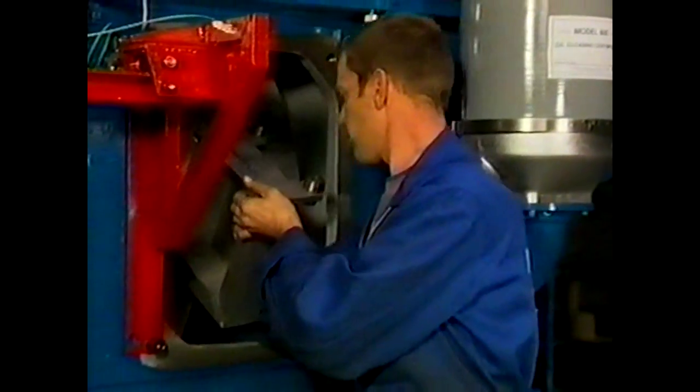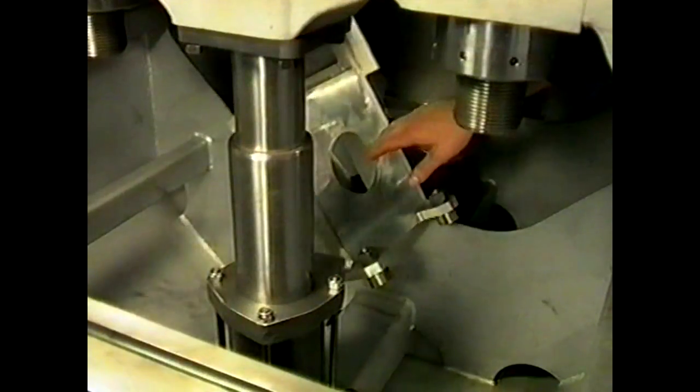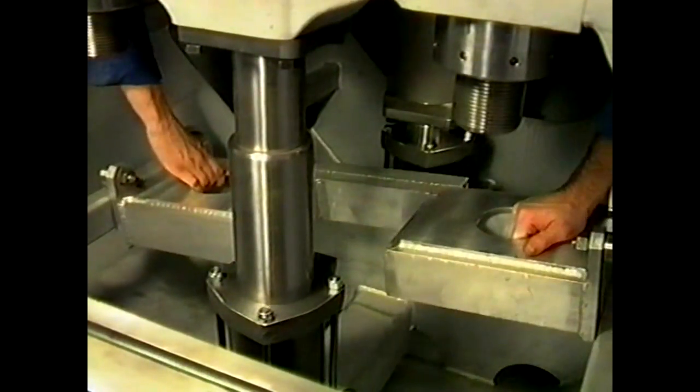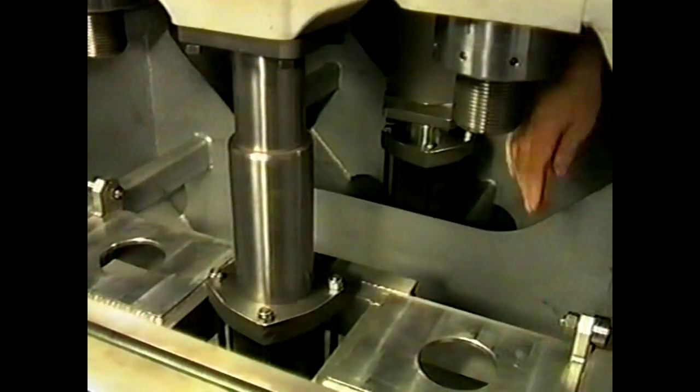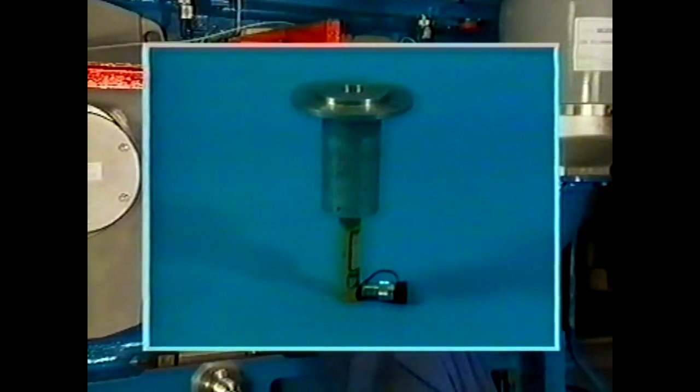The engine is equipped with a bearing monitoring device — a sensor is fitted on each main bearing cap. The sensor can be detached by disconnecting the banjo union; this must be done before the main bearing cap is loosened by jacking. A trolley placed on the rails in the oil sump is used to position the jacks of the main bearing cap under the studs. Place the long stroke jack in the trolley with the rotary disc pointing upwards.